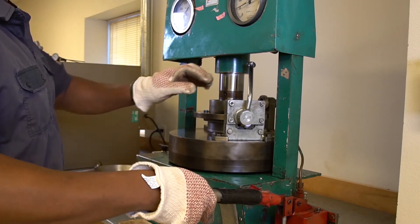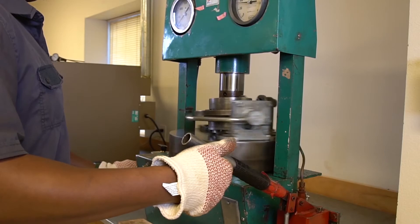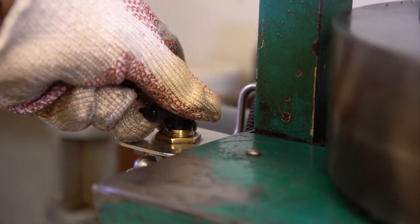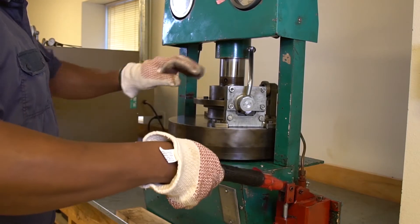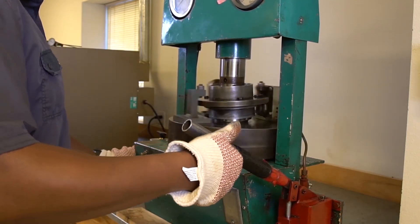During molding, when one stroke of the pump causes the gauge to come to rest between 50 to 150 psi, drop the pressure below 50 psi, then pump the pressure back to 50 psi. Repeat until one smooth stroke of the pump will cause the low pressure gauge to indicate a pressure of 150 psi or more.